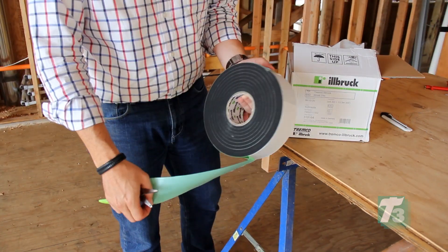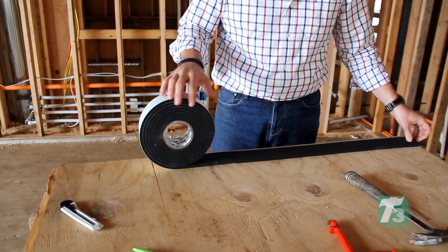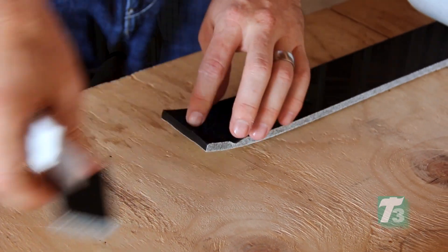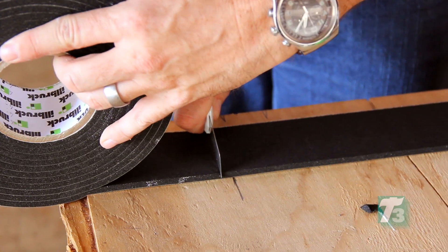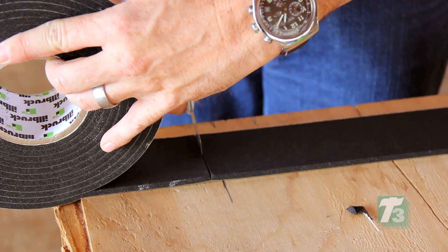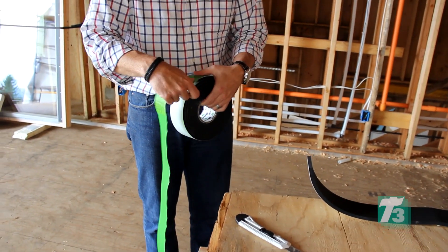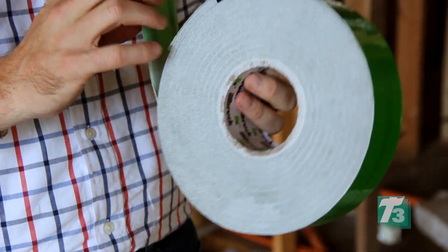Unroll and save the green compression tape — it'll come in handy later. Then roll out the Trio, cut and discard the first two inches of Trio on the roll. When installing the Trio, make sure it is in a relaxed state and always add 5% to the measured length before cutting. When finished with the Trio, wrap the green compression tape back around the roll. This will prevent it from prematurely expanding.